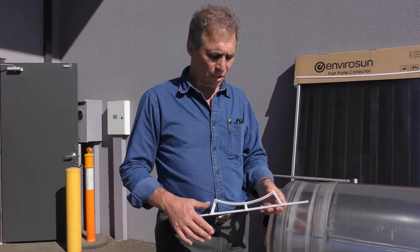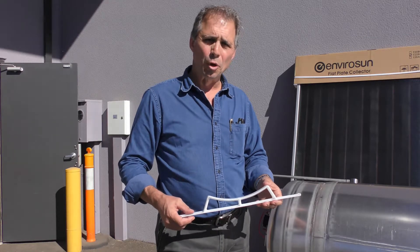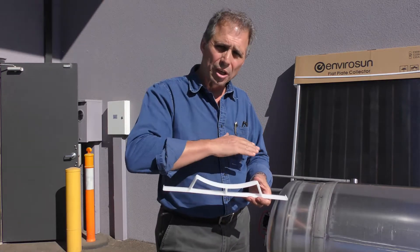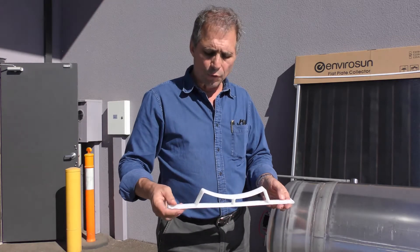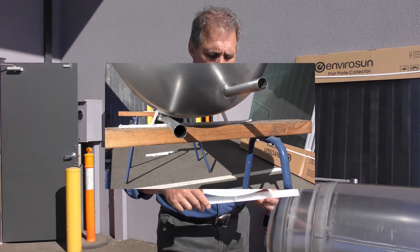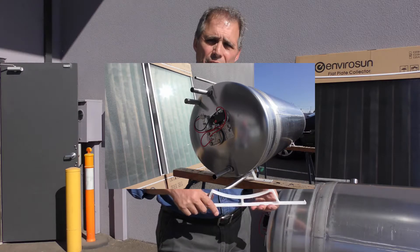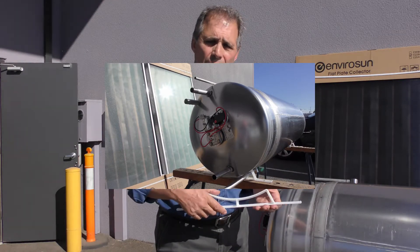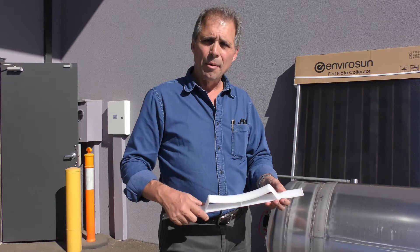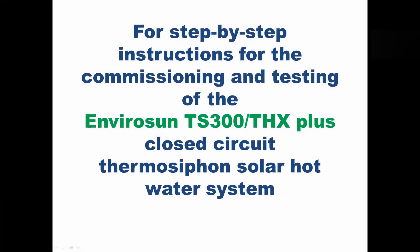You'll notice we have a polypropylene cradle that the tank sits on for production purposes — we need it up off the bottom of the case to allow the polyurethane insulation to flow underneath. It's only used to maintain the distance between the bottom of the tank and the case. Given it's polypropylene, there are no metals in contact with metals, which provides better insulation, eliminates heat bridges, and prevents any corrosion at a later stage. There are two of these in each tank — a little detail that reflects the quality of the product we build.